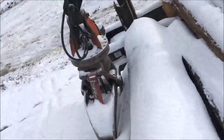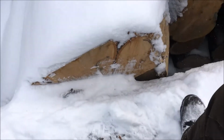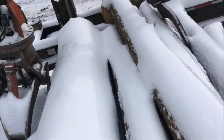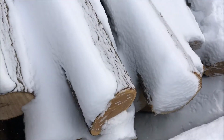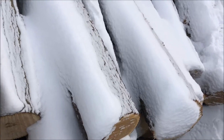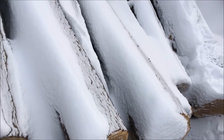It's hard to get good clean logs out to 16 feet unless you're cutting some big chunky timber. Like this one here, this is a big red oak, and it was big and fat, so I cut a 12 out of that, big, fat, straight, and clean. Now you start getting into some of your smaller logs, like this cherry here, 12 to 14 inch. The longest I'll go on something 12 to 14, unless it's gun barrel straight and paying really nice, is usually about 10 footers.